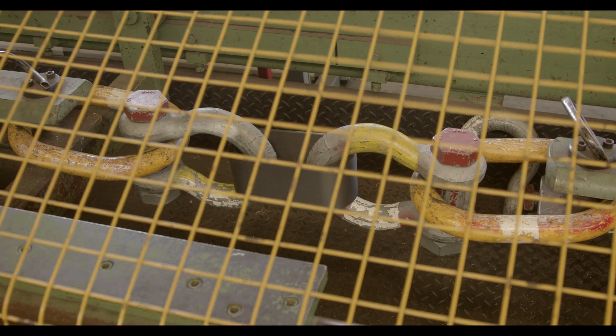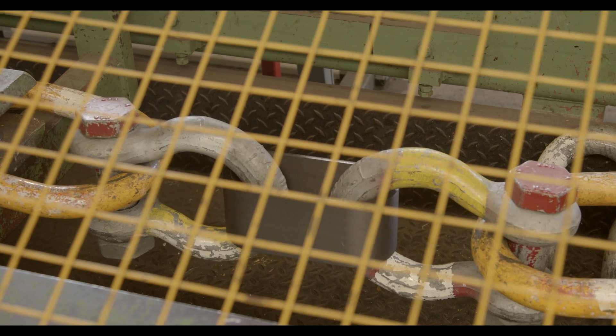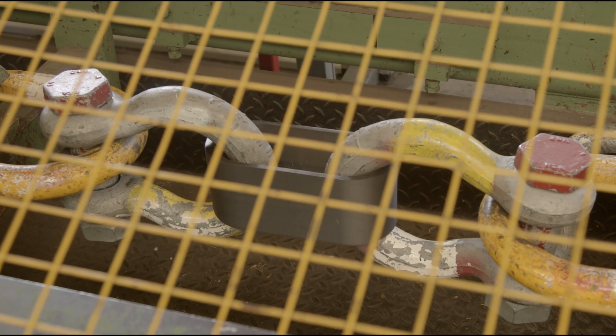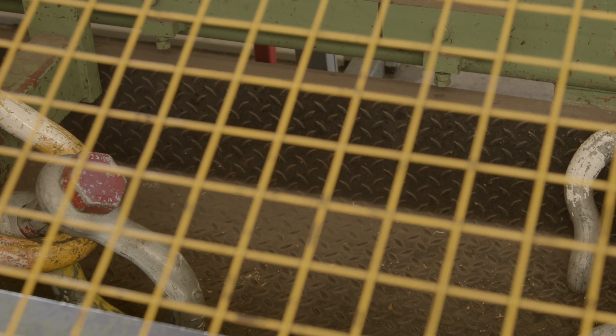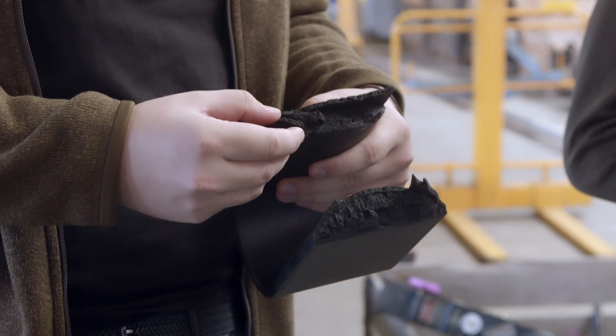The Royal Netherlands Navy then tested the parts extensively using a specialized unit for additive manufacturing called the ECAM. After several tests, we had a clear winner. The one-kilogram link was able to withstand 12 tons, while the two-kilogram link was able to withstand 38 tons. We were very close in our predictions, and we were only under-predicting by 2 to 3 percent.